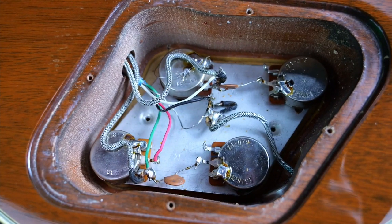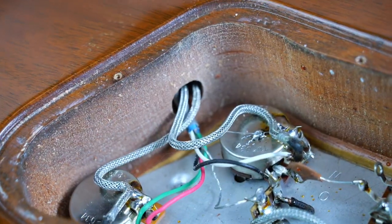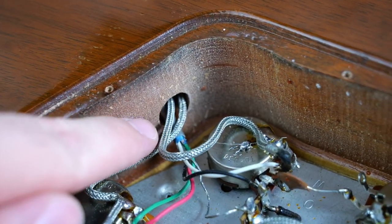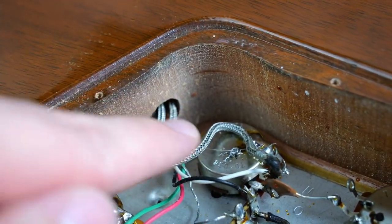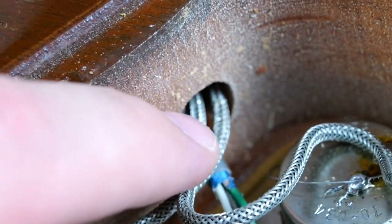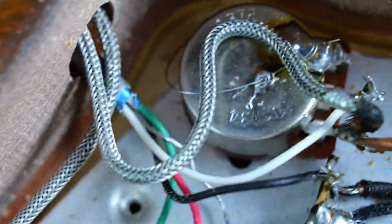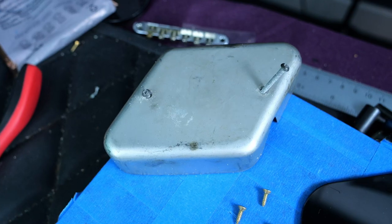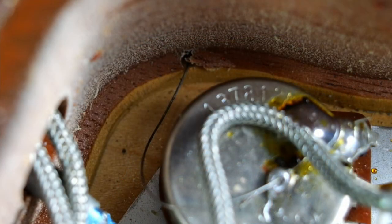Speaking of beautiful, look at our untouched electronics. So I'm gonna go ahead and say it, this does not have weight relief. This is probably one of the older bodies that they just had laying around because it's before they switched to the CNC routing. You can tell by the circle channel route right there. Then we can see our pots right here, which all date the way I would expect. Looks like 81s for here, 82s there. And it does still have the shielding tray here with a factory ground wire.